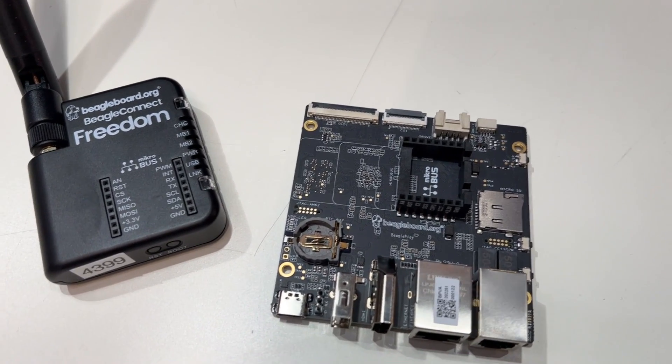We've also got Grove and Qwiic, and we've got some really innovative connectivity options with single pair Ethernet and sub-gigahertz wireless. To make the sub-gigahertz wireless super useful, we've also got the BeagleConnect Freedom, which is using the same microcontroller that we have on the BeaglePlay to do the wireless connection. It's a Cortex M4 applications processor running Zephyr, and you can create a wireless connection up to a kilometer away at a kilobit. We have two MicroBus ports on the BeagleConnect Freedom, and that allows you to extend the reach of what you can do with the BeaglePlay.